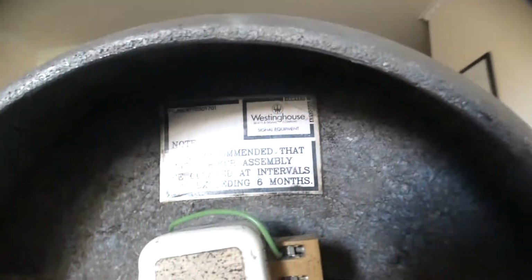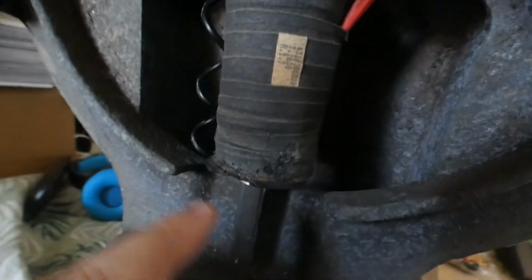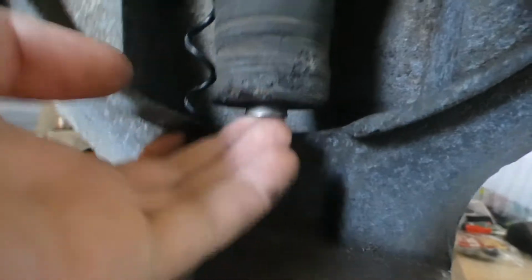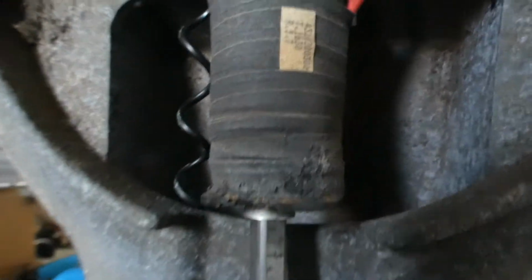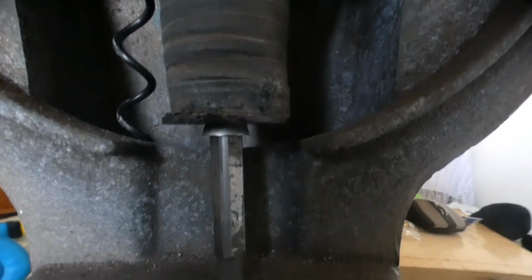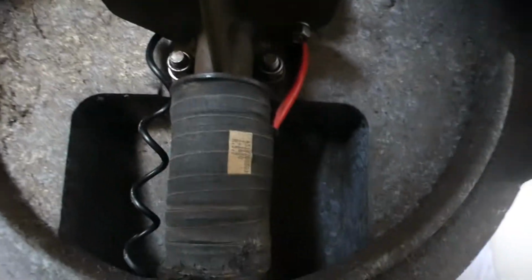I'm not sure what this is called on the hybrid bells, so I can't tell you what it's called. You have the terminal block with the wires and the electromagnet. And it goes up like that, and moves up and down like that really fast. I believe this is a switch that turns off the electromagnet when the bell bangs. Yeah, it strikes the bell gong.